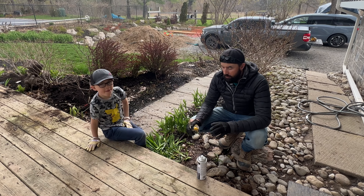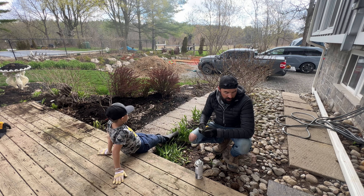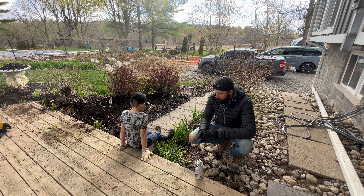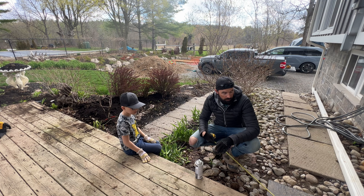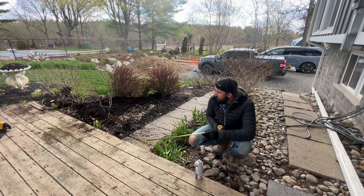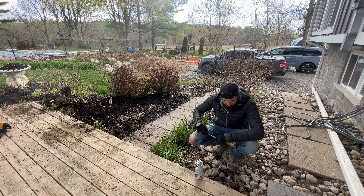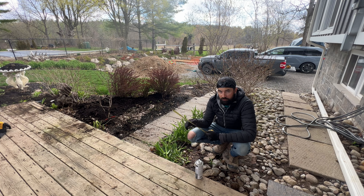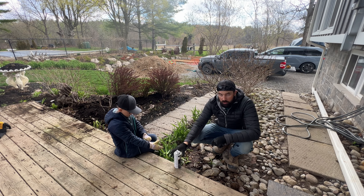The first thing you're going to want to do when you're building your fence is decide on your post layout. I'm going to build my fence along the perimeter of this deck and then I've got a straight shot over on that side. I'm going to try and keep it to an eight-foot spacing for the posts, but there's a few spacings that aren't going to be eight feet. I'm going to have a gate right here which is 36 inches wide, a post a couple feet away right at the corner of my house, and then I'm going to split the difference between the span from the last gate post to the corner. So I've already measured this — my gate is 36 inches from here to here, and from there to there is 12 feet, so I'm going to split the difference and have a post centered right in the middle at six feet. I've done the layout with a tape measure and painted the location for each post on the ground so I know where to dig.